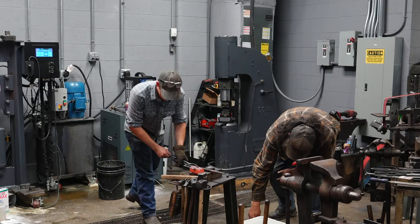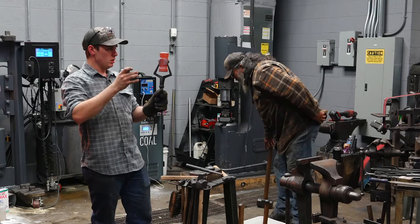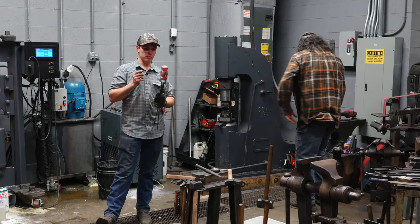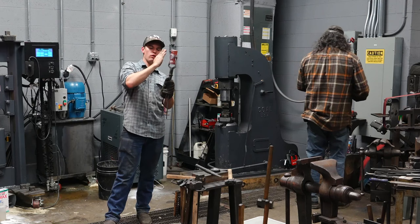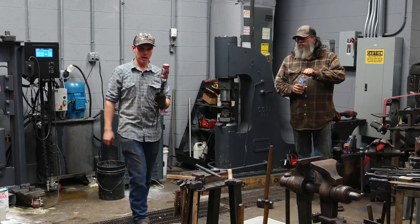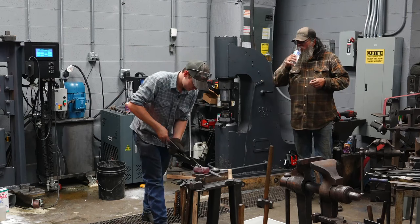The reason that I don't want to upset it now and push it hard now and try to forge the faces now is because I've forged these troughs now that are smaller than the diameter of the faces. Because that has the weakest structure, that's where the steel is gonna move. And I do not know if it's gonna move evenly. Because that probably will not move evenly, that's where you get problems like the face leaning over, okay? Or a hammer where the cheeks are over here and the faces are over here. A U-shaped hammer, does that make sense? Bent like that, that's where those problems come from, when you're hitting on it and driving on it hard after you forge the troughs. You want to get all that upsetting done before you forge the troughs. So now we're gonna go in the other side of the eye in the next heat.